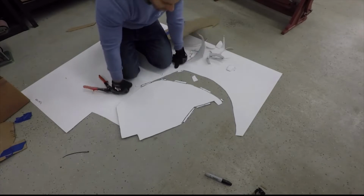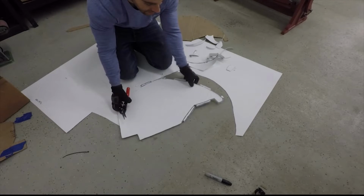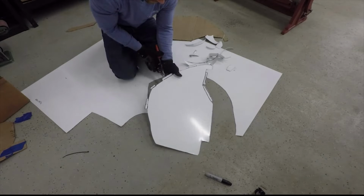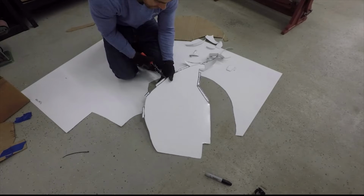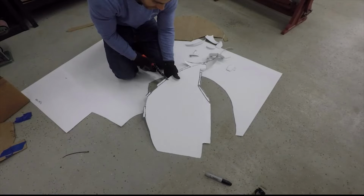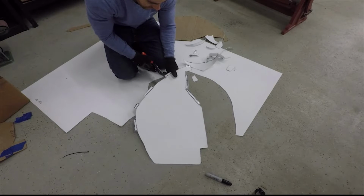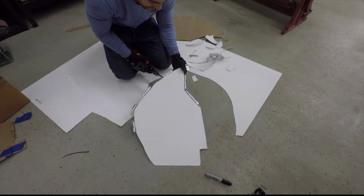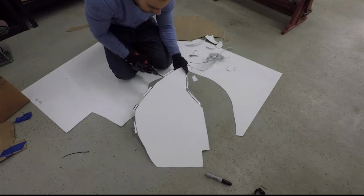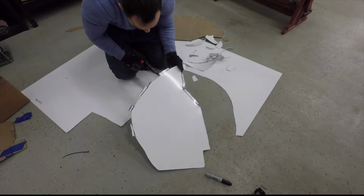So now, before I actually bend all these tabs, I'm going to actually create a tear in the aluminum, and that's so that it can bend easier. Normally we would design what is called a relief, so that the parts can actually cut or be bent without distorting the main piece, but these are not water jet cut, so all I can do is create a tear basically.